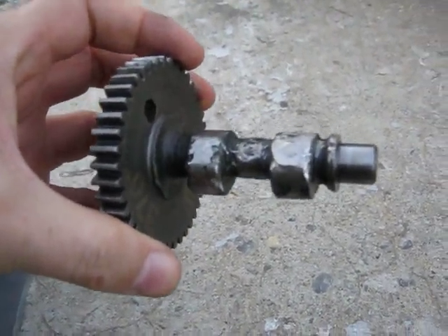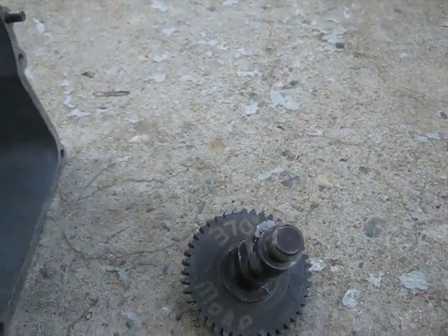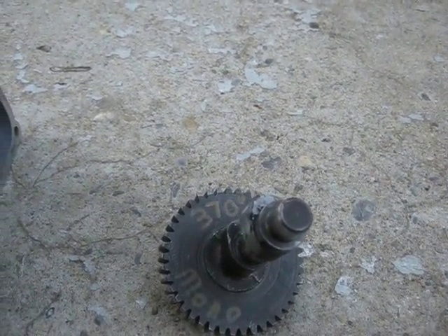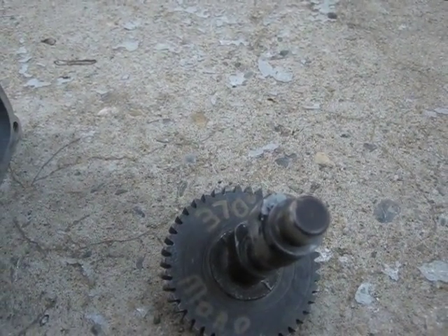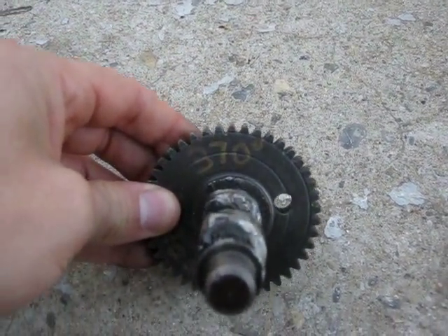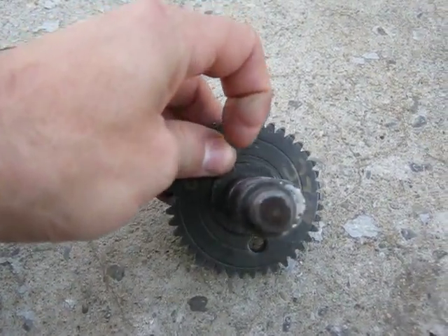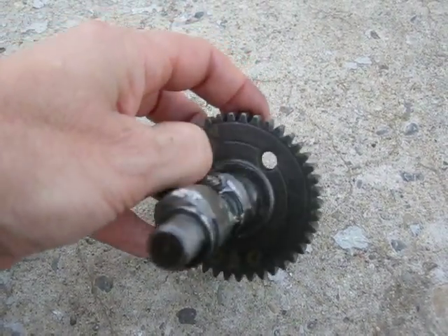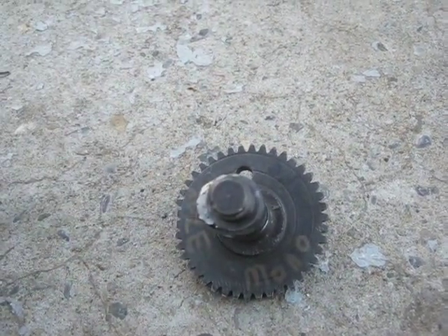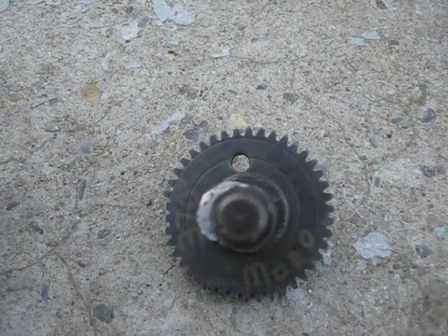You have to modify the camshaft, using both lobes. I actually opened the normal exhaust valve before I opened the intake valve that's now exhaust also, just to not heat up the intake valve as much. As you can see, there are pretty brutal lobes on there. I got 370 degrees duration written on there, and that's true. It starts out flat here and you rotate it around — by the time it closes, the camshaft has rotated more than half a turn. So at your 720-degree cycle, it's about 370 degrees of exhaust valve opening.